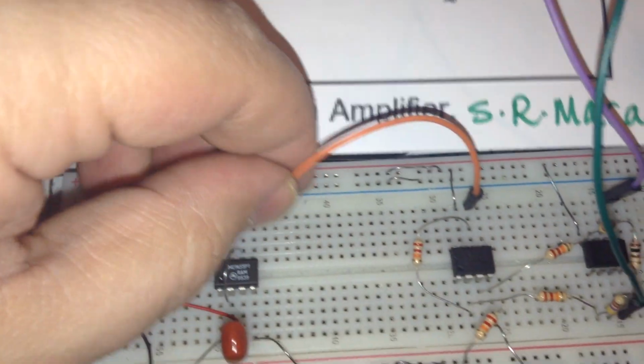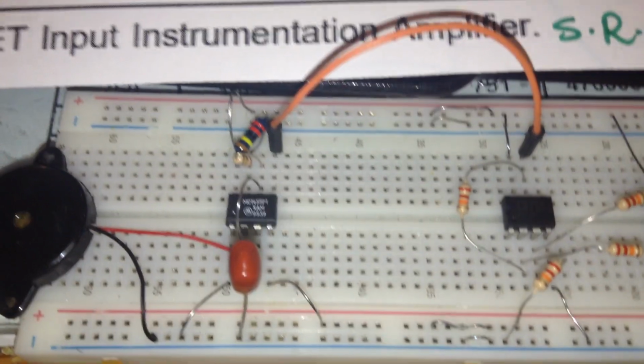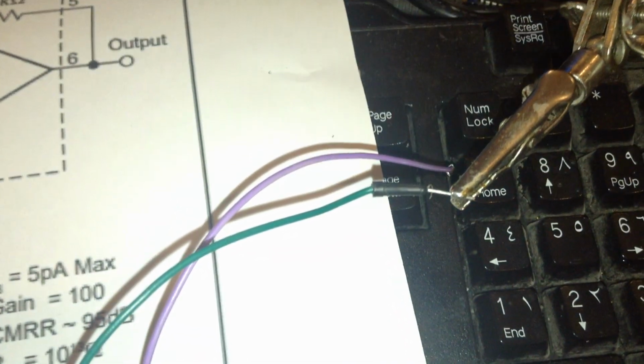And as you can see, when I'm connecting the project to the 555 input, we have a very simple output when I'm touching the plates. And also the other lead is connected to this hanging solder here. I'm not sure that you feel the oscillation changes or not, but I use the 555 to feel this measurement best, because the amount of change is very small. And with the multimeter, it is not easy to check this exactly.